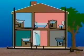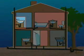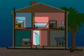To determine whether you are using the proper drain cleaning tool, you must first locate the source of the problem. If the clog is in a small drain line like a sink drain, tub, or shower, the Super V is the appropriate tool to use. If several drains are affected, then the blockage is probably in a larger line common to those drains. If this is the case, the Super V is not the right tool for the job. Consult your dealer for a model designed to clear larger drain lines.